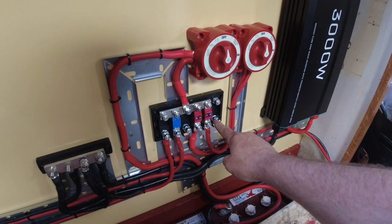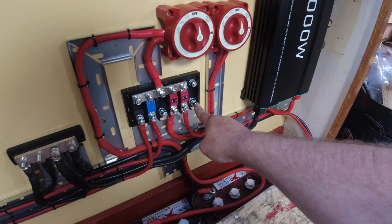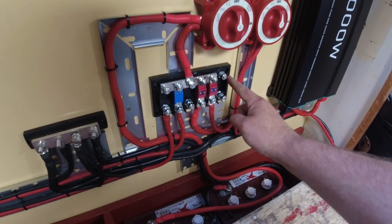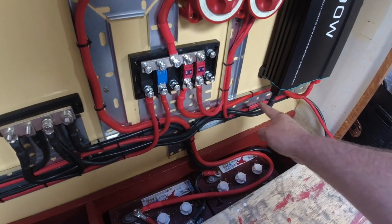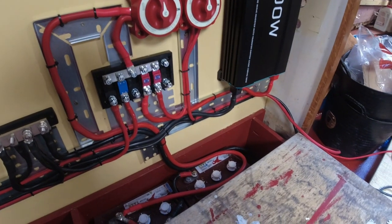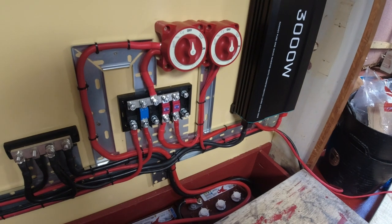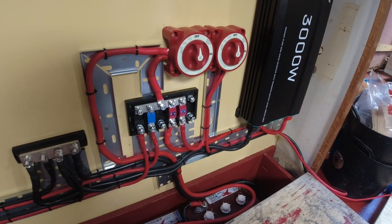And then at the bottom here will be bilge pumps. So I'll be running three bilge pumps off that. What I'll do is I'll bring the wires down here somewhere, run them off, then at the side here, somewhere around here, maybe somewhere else, there'll be a small separate fuse board that'll have three fuses in to run the three bilge pumps that will be fitted on the boat.